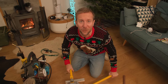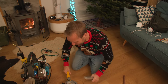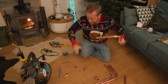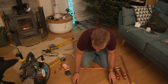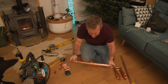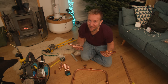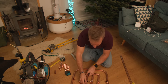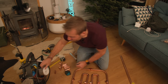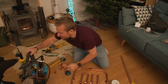Maybe they think there should be more than two types of fitting. Anyway, we are cutting these down to size now. We've got this little beast here built up - it's not soldered together yet but that is what we've got. We've built two U pieces - I'm going to get these two U bits soldered up now. Little trick: if you get some olives from your local market, put your wet rag in that and it won't dry out. All these little things make our lives slightly easier. Today I'm actually going to use my homemade heat mat.